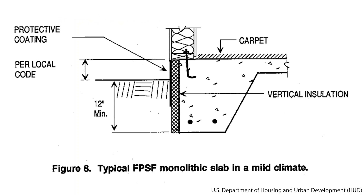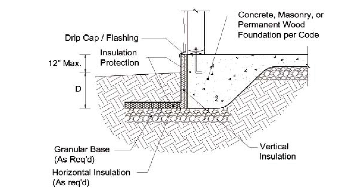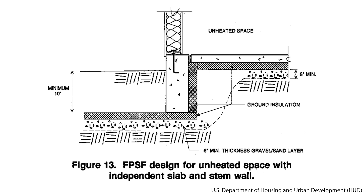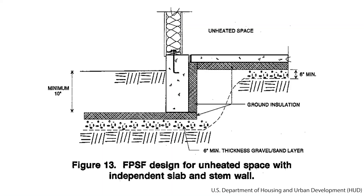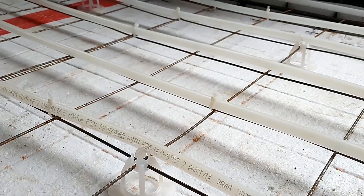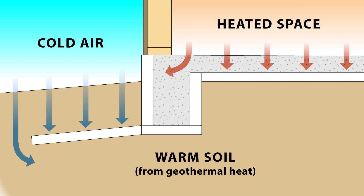There are ways to design frost protected foundations for both heated and unheated buildings. The detail for a heated space looks a lot like traditional slab on grade construction, but with the addition of vertical and horizontal insulation at the perimeters. For unheated buildings, there are a couple of methods: insulation in a single plane beneath the structure, or insulation just beneath the concrete slab. My garage will be unheated, so I needed a design that protects the entire slab from frost heave. But somewhat last minute, a friend convinced me to run PEX tubing in the slab for future hydronic heat — it was a one-shot opportunity. So my insulation should protect against frost heave when unheated and from heat loss when it's being heated.